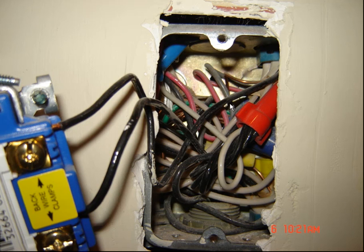I've got to trace all these Romexes out and find which direction they go. The whole room right now is completely on one circuit when they had intended three circuits. The whole room works fine — you can turn everything on and work it. I didn't even bother checking the load balance, but this is just another one of those things I run into on a daily basis.